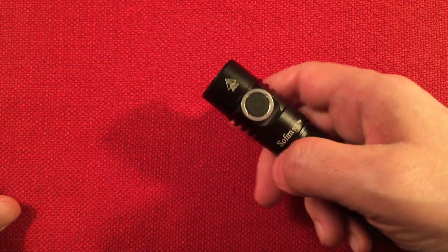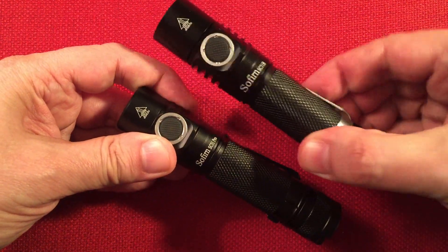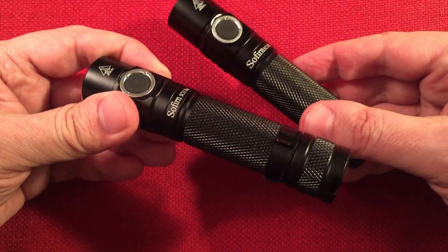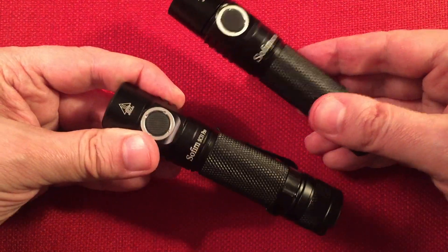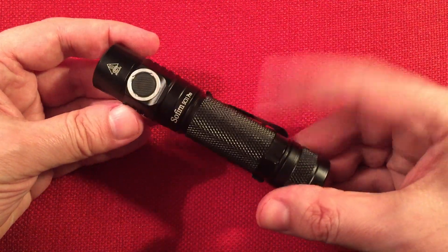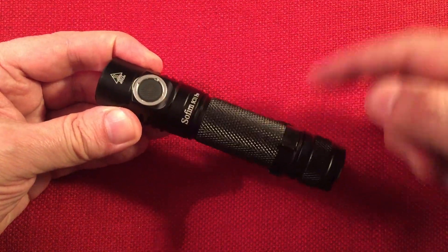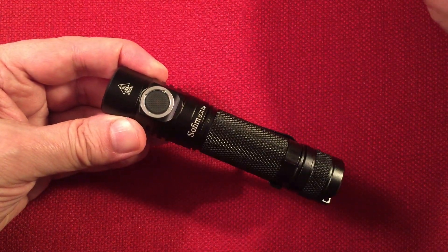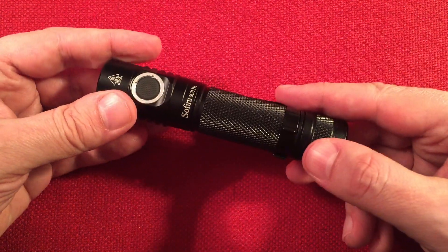This is a great flashlight — I'm really enjoying it. I reviewed the SC31B when it was 19 bucks. Now it's like 25 or 27, so just spend an extra 10 bucks and get the Pro. You get a better battery, a better flashlight, and a better LED. It has low voltage protection so you don't over-discharge your flat-tops, reverse polarity protection, and advanced temperature regulation which is adjustable. It's set at 45 degrees Celsius before throttling, and you can set it from 40 to 55.